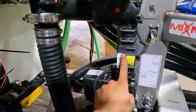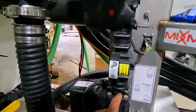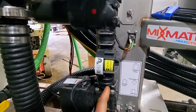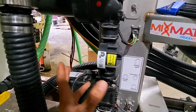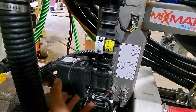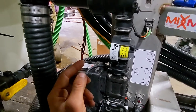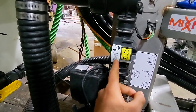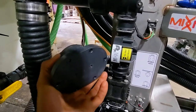All right, update on this flow meter. I talked to the Praxidyn guys and they said that according to records, while this was on the legacy system before it was shipped out, Daltmeyer tested it at their facility, I guess tested batches with it, and they probably didn't realize it was going to sit for 2 years. I'm sure they didn't realize it was going to sit for 2 years. And the thought is that it never got winterized and the flow meter froze, is our best guess.